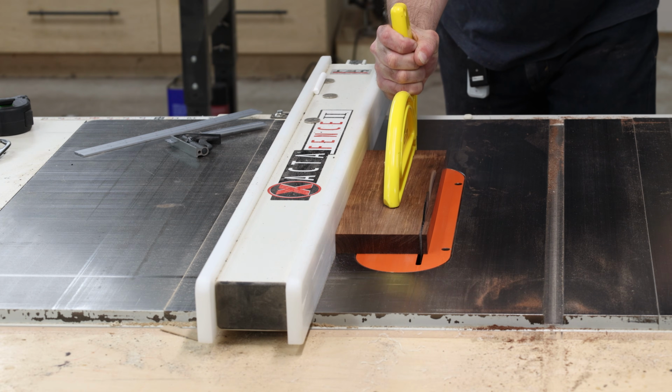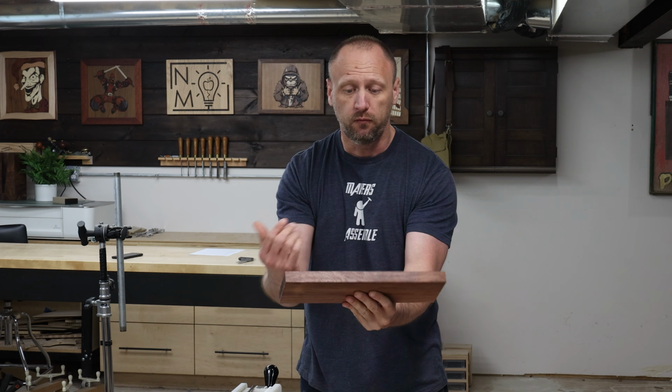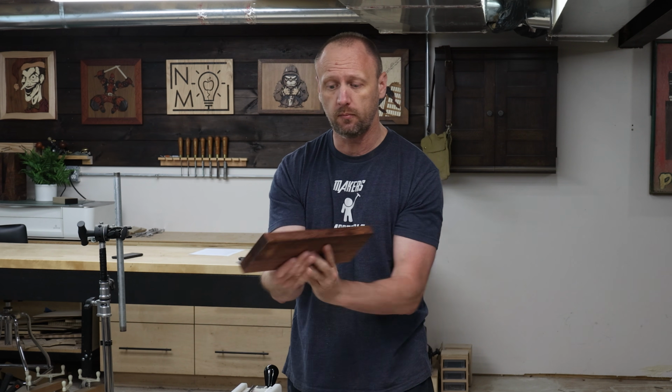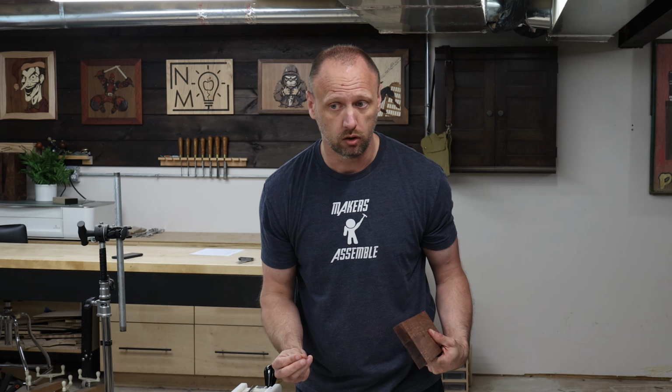I'm thinking that this serving board's gonna have a tray that slides out from underneath. I'm gonna have to cut my base in 3 pieces. But before that, I wanna make sure that I've got some continuous grain, or as close as I can get it, down both sides. So I'm gonna cut strips off of both sides, set them off to the side, do my thing, and then put those back on, and that should give me the look I'm looking for.